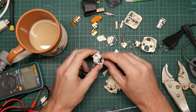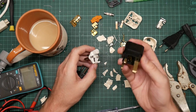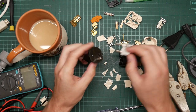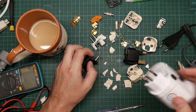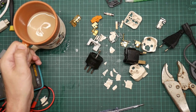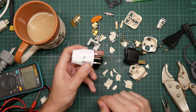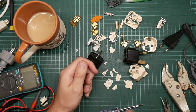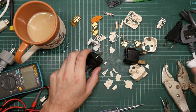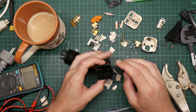The conclusion is pretty obvious: if you get one of these death adapters with an appliance, throw it away. Go and get a proper adapter — whatever your country's equivalent is — or what I normally do, which is to simply buy some local plugs, take a UK multi-adapter, chop the plug off the wire and put the local plug on instead. That way I get proper sockets for plugging my UK appliances into, and a proper plug for the Swiss wall. But these death adapters — they suck. Just throw them away.